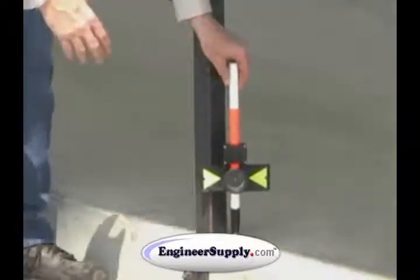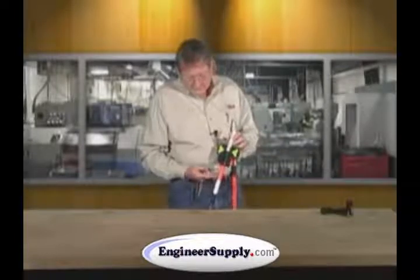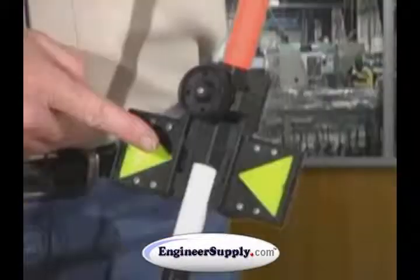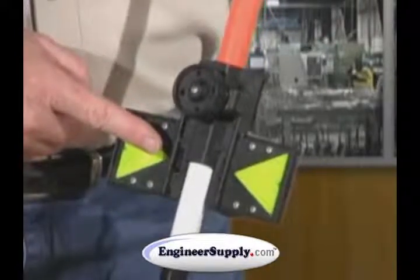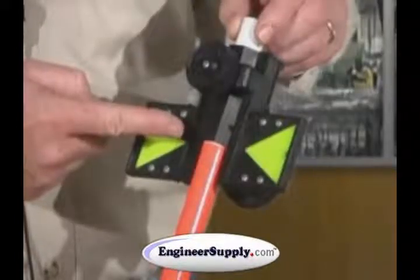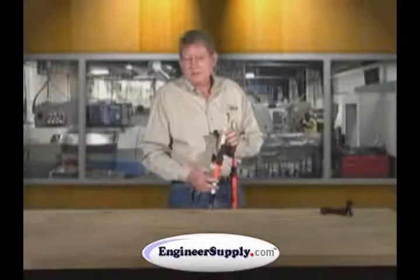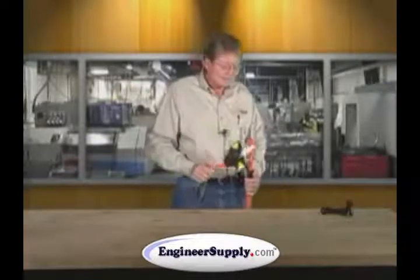The prism comes with a bubble, so there's no leveling or extra vials or rod levels needed. We've designed it in the upside-down mode so that the first mark, if you set it on that height, is 0.5 feet above ground. The next height mark is an even one foot above ground, making it very easy to get good elevations with your known heights. It's a very powerful system matched up with the prism.